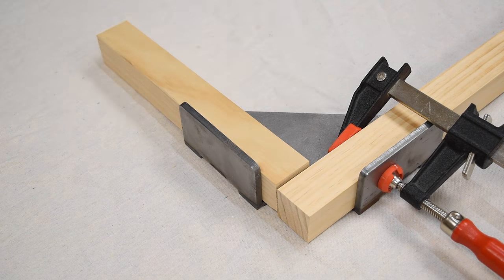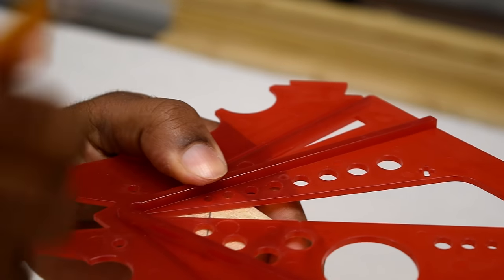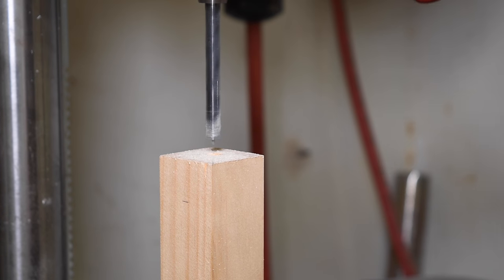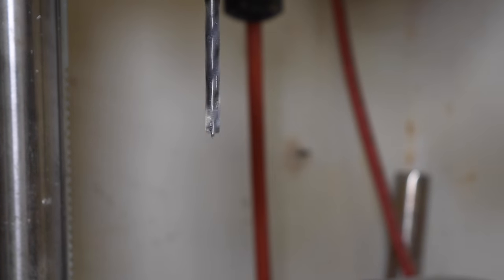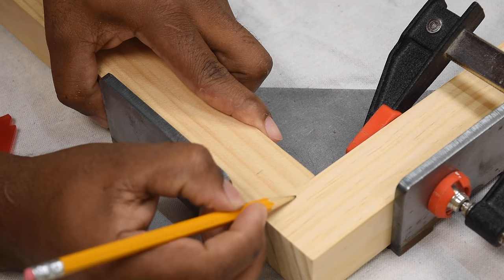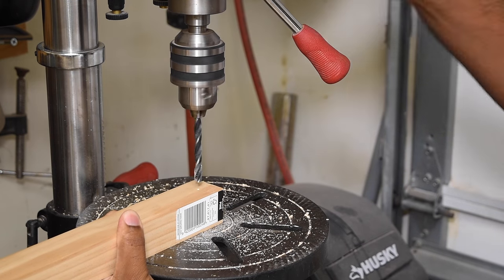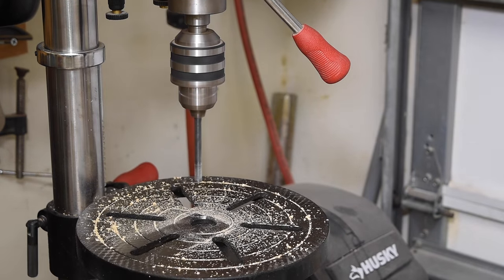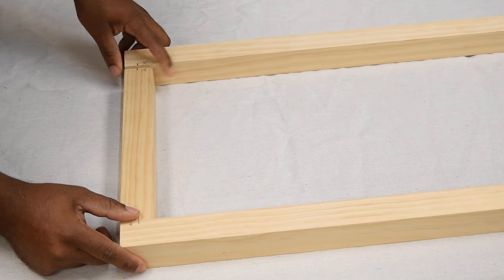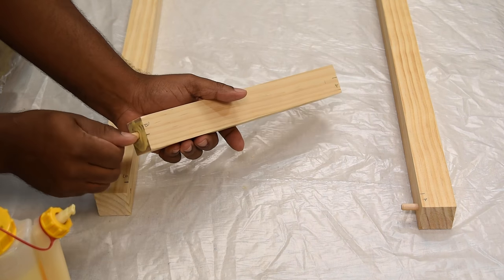To build the two frames I'm going to use wooden dowels. I'll find the center of the smaller pieces and drill a hole there. With that hole I can then use a dowel center to mark the adjacent piece. Just in case I'm off-centered, I'm going to mark both pieces so I know exactly where they go. Then I drill a hole in the adjacent piece, and if everything was done right it should all come together perfectly. I repeated that step three more times until complete, then once I double checked everything I glued them up.